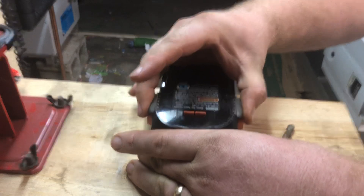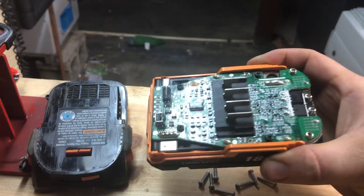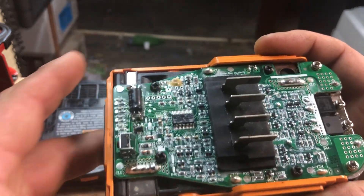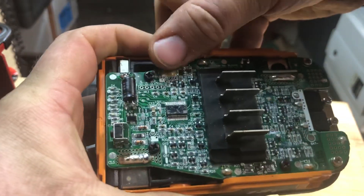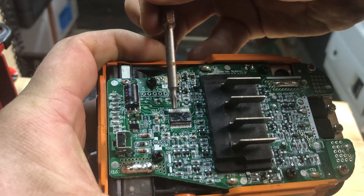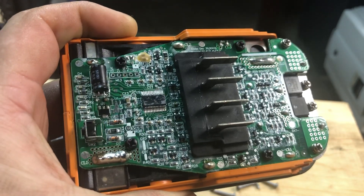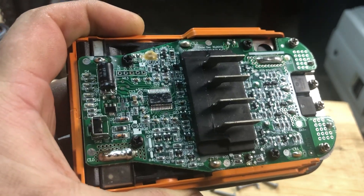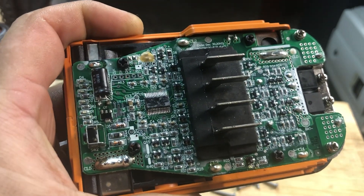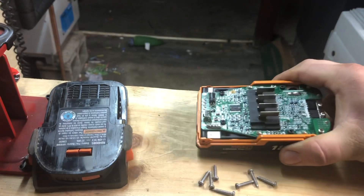This is an 18-volt system, so I'm not terribly worried about getting hurt. On the board there is one chip of interest. The top of this chip had a lot of corrosion from water ingress, so I had to clean it off gently. There's a conformal coating on top — I definitely removed some of that by not being gentle enough. I used a very fine pick to clean between the legs because of that green crusty corrosion you get.